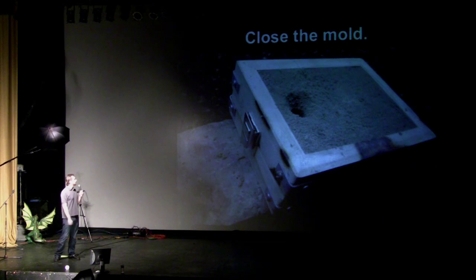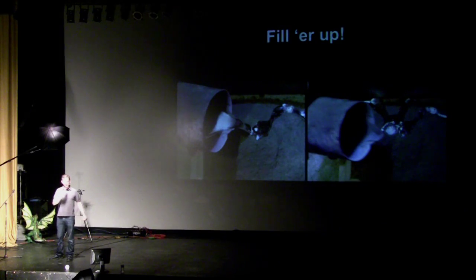This is where it starts to get fun. Close the mold — you want to blow out any loose dust, make sure it clasps. The cope and drag on that model had a little hook that holds them together. That's important because when you pour the metal in there it's very dense and the top of the mold can float up. Not only does that keep them aligned, but it keeps the whole thing together. I've had molten metal around my feet more than enough times.